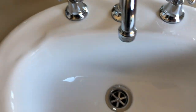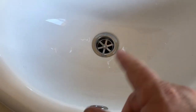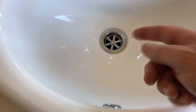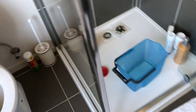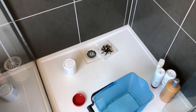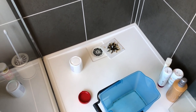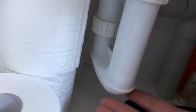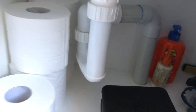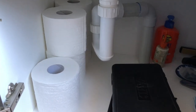For a normal drain like a kitchen sink or basin with a metal drain plug, after pouring the caustic soda in you need to rinse it off the metal so it doesn't corrode and start to rust. Also, this house is on a concrete slab so there's no way of getting underneath or a U-pipe to clean. In a cupboard though, there'll always be a U-pipe. Two lock nuts — one there, one there. Put a bucket underneath, undo the lock nuts, pull it out and you can clean the pipe out and clear any blockages that way.